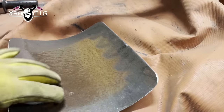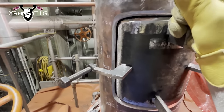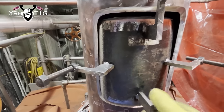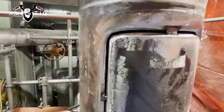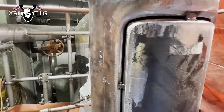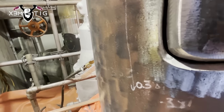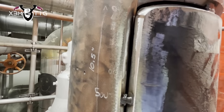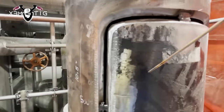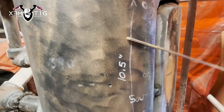With existing pipe there's no need for PT on the new piece. I'm gonna shape it out so it can match that hole. I'm gonna put four dogs — four little dogs on each side — then put it inside and tack it. I'll put three bridge tacks to hold that plate in place. It's a full penetration — it's like a closure weld. You've got one vertical and two horizontal welds, same thing like on a regular butt joint, but in this case it's a patch so both edges, both ends, gotta be beveled because it's 100% full penetration.